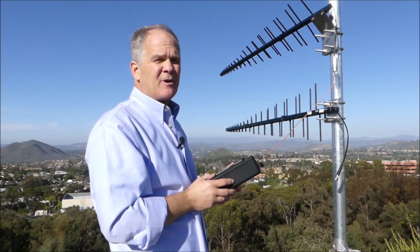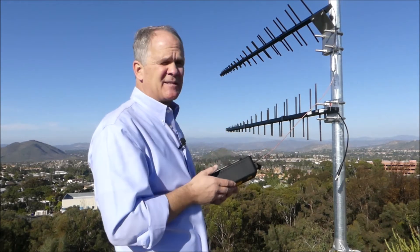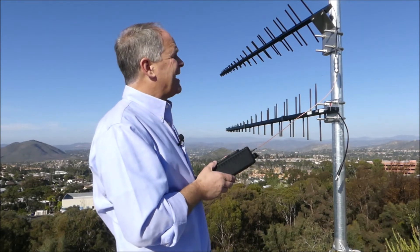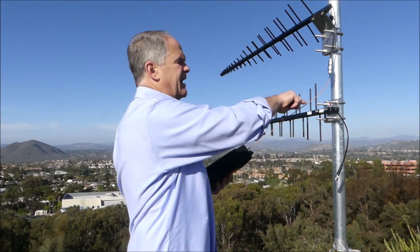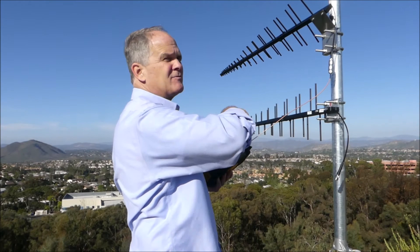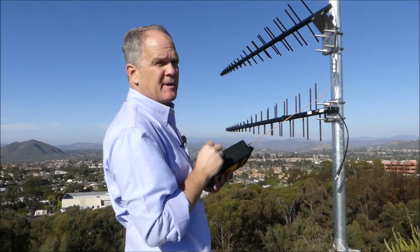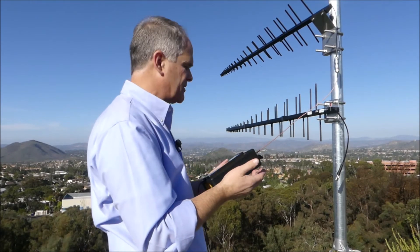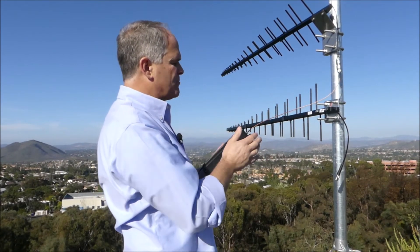At this point in the installation process I have installed my donor antennas at the optimum place that was determined during the site survey. I've also swapped out the vertical polarization mount for the 45-degree polarization mount that comes in the box — that's just another trick to improve your signal-to-noise ratio. I've connected the main port on Compass to that antenna.